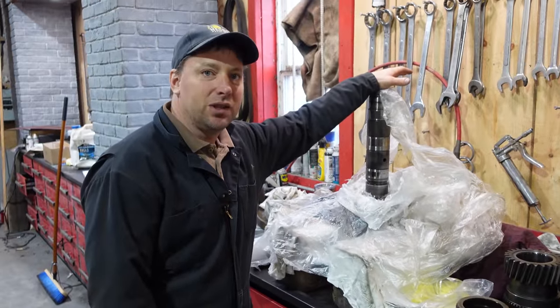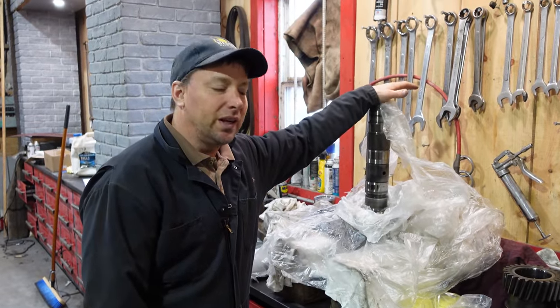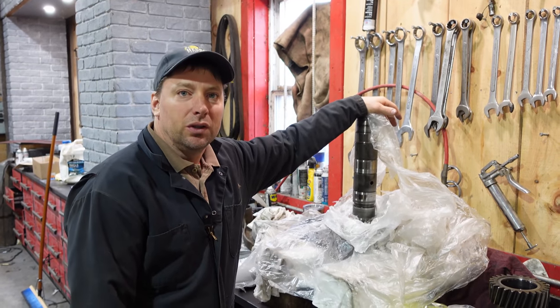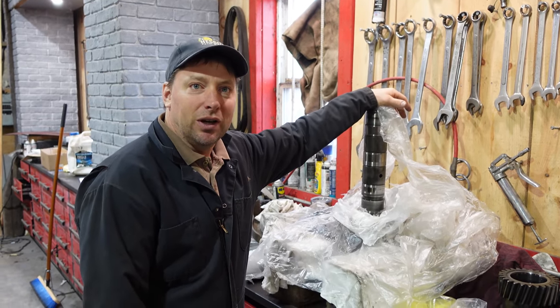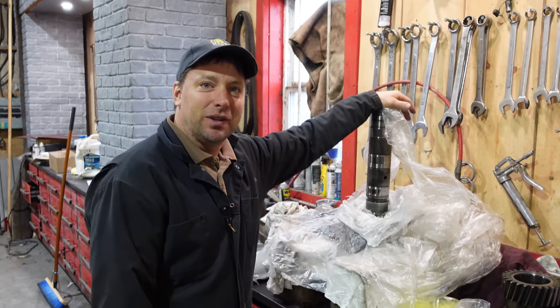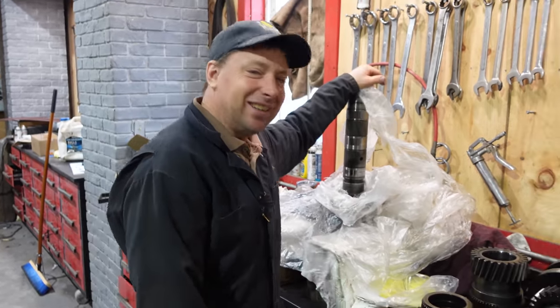They said they're rebuilding transmissions usually at about 8,000 hours on them. Okay. So we got about half that. Our bearings all still look good and everything. So if I put 200 hours a year on, if I get 2,000 hours out of this fix, that's 10 years. Very good. By then, we'll be driving electric tractors.